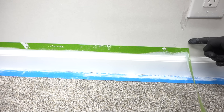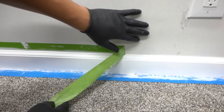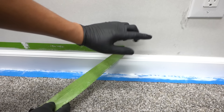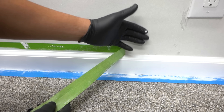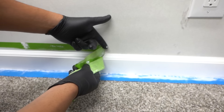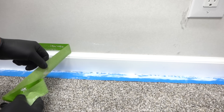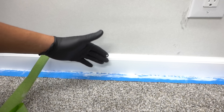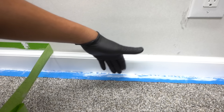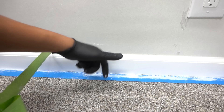This is just a mock-up and it's not painted — it's fresh drywall. If it were textured and painted, you'd have a much lower chance of tearing. But since it's just fresh drywall paper, it is starting to tear as you can see. Also note: if you take this off early while paint is still wet, there's a possibility the paint at the top will drip down onto the carpet, so wait a few minutes for it to dry before removing the bottom tape.